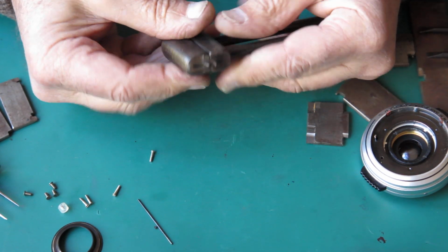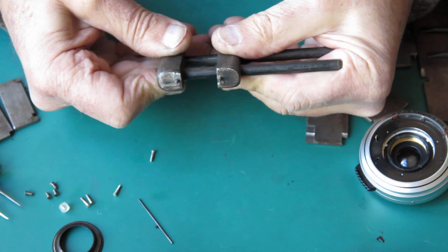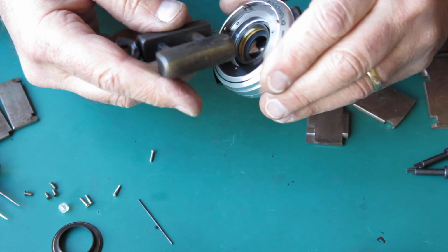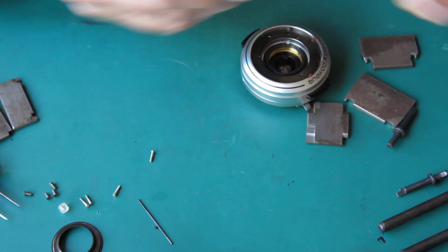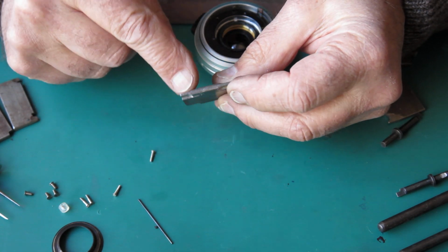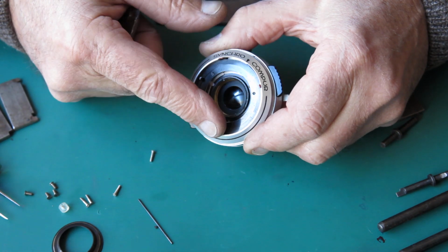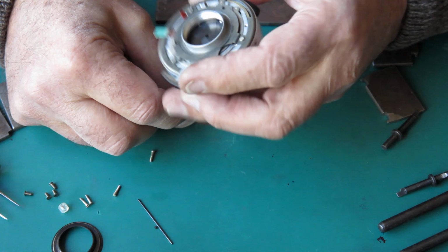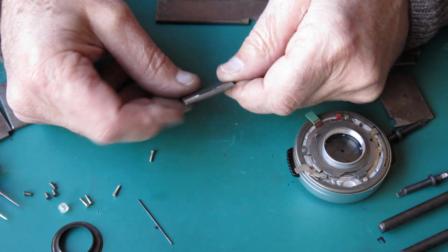I made this once upon a time too, when I needed to get something loose, and basically it's just a pin spanner arrangement, adjustable, but you can get an awful lot of good leverage on that to get things loose. I don't think I've got the depth there to get those pins seated in there, otherwise that would be a goer. So what I'll do is make something that'll do that job, probably on this pattern. This pattern's quite good. You can see it's just got a narrow slot there, a piece to engage the slots. It just has to be narrow enough to fit inside this gap, and in use I just place that in the vise with just the top piece sticking up, engage the shutter on it, twist it with your hand, you'll get it loose, no problem at all, no fights, no damage to slots or anything like that.